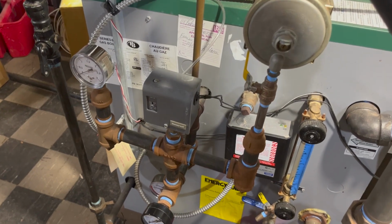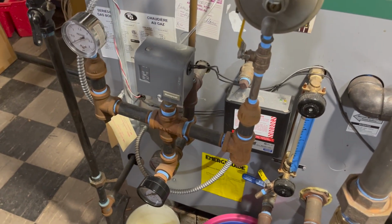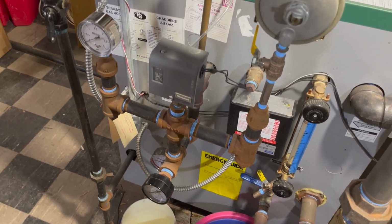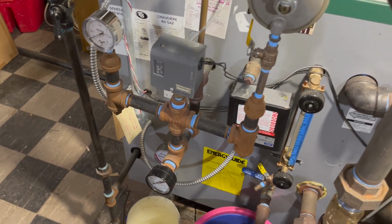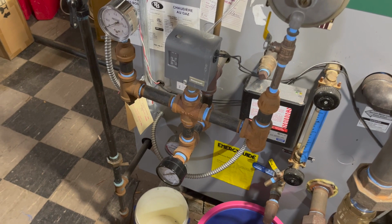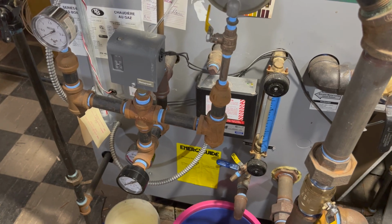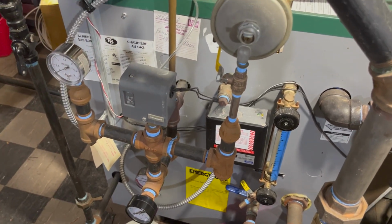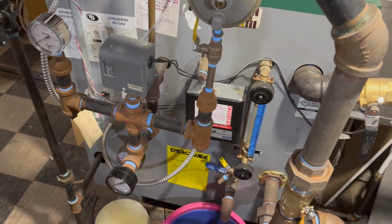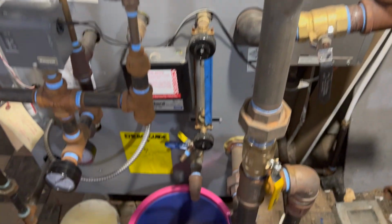And shooting out of your main vent, which, if that was a thing that could happen, would be a concern, because 3 PSI is nearly 90 inches of water column. If there was a differential like that, it would cause the water to rise up to the end of your main and shoot out of your main vent, or even go further, up to your first floor radiators, let's say. And so that's what the equalizer supposedly does.